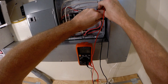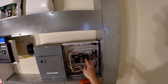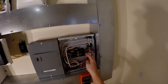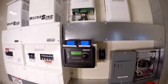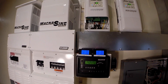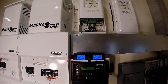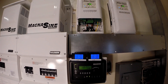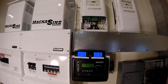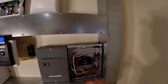There we go — pretty unstable, look at that. There's no load on it. When I switch this on, that should put the 240 up here, it should qualify and auto-connect, and start charging. Let's give it a go — okay, turned it on... and it turned it off. It didn't like it. Now it is charging — no, it doesn't like the power. It's too unstable. Dang, all right, let's cut that.